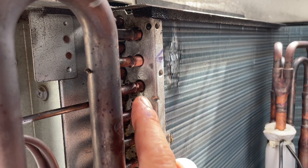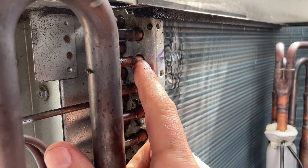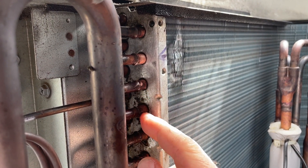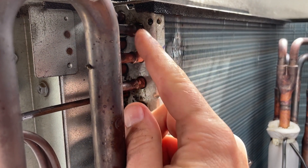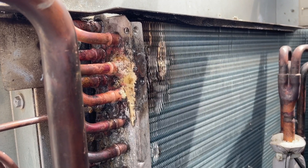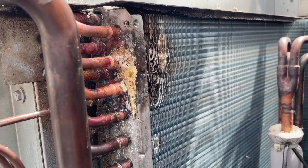The other advantage of doing it this way is that once I join these, it's going to keep this plate from flapping around and causing other leaks and problems at these adjacent joints. Got it under nitrogen pressure with the big blue on it and it is leak-free.